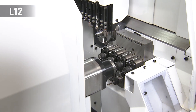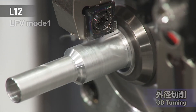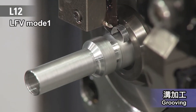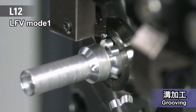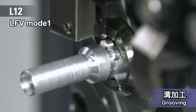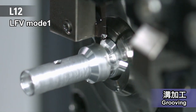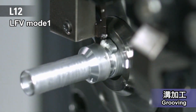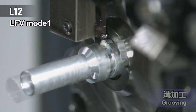The side effects from LFE are better tool life because you get reduced heat in the insert. You can get better surface finish because of the way LFE works — you're almost getting a wiper effect. You can eliminate roughing passes so you can do heavy depth of cuts. I know guys doing automotive components in difficult materials doing things like 10mm depth of cuts. On a big fixed head machine that's a big depth of cut — on a slider, that is absolutely unheard of — but LFE gives you the ability to do big depth of cuts.